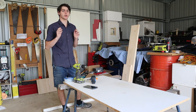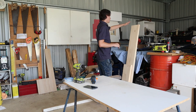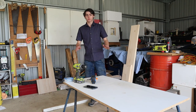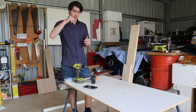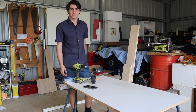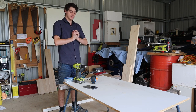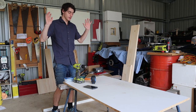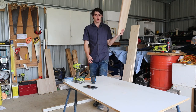I like to work on one shelf at a time. So we've got our first shelf here — there are two top and bottoms and there are two sides. Now there are multiple ways you can attach these: you can use dowels, just normal screws for the top, or dovetails if you really want to go very fancy — there is literally a million ways. But what we're going to do for this one is just a quick and simple pocket hole screw. I know a lot of people don't like these, but in reality they're perfectly fine and perfectly strong.